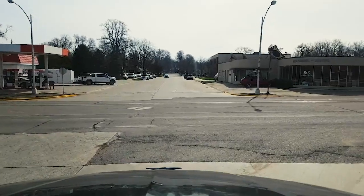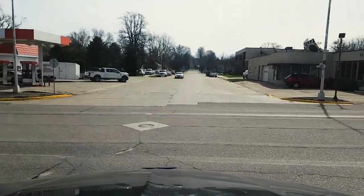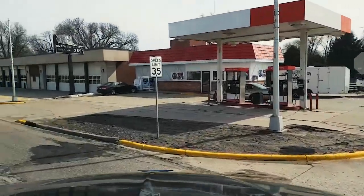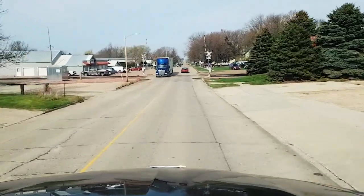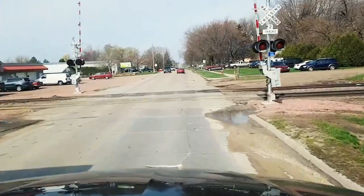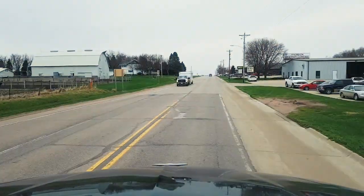Let's jump into the truck and get out on the road so we can see what this suspension does. Link's test truck is a 2016 Peterbilt 579, which delivers a fairly nice ride to begin with. First, we'll drive over a stretch of road with a washboard texture, and then we'll run over a couple of sets of railroad tracks for a jarring sort of bump. Link's crew will then switch out the stock cab suspension, install a Cabmate ROI semi-active suspension, and we'll drive over the same course one more time.